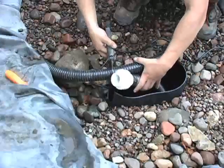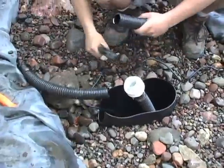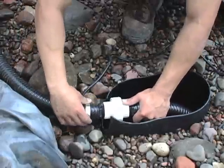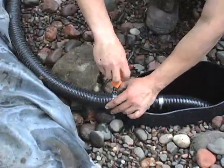The pump will be housed at the bottom of the snorkel vault. The plumbing from the waterfall unit can be trimmed to proper length and inserted through the snorkel inlet. A plumbing assembly or check valve will be provided in the kit and will need to be assembled. Review the installation instructions for assembly details.